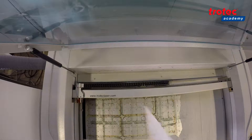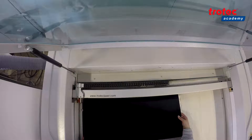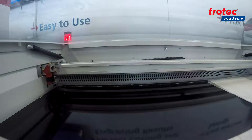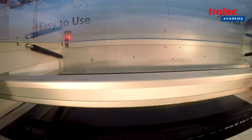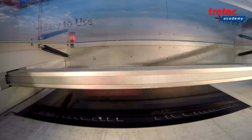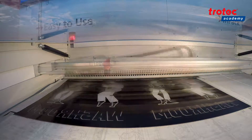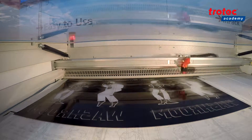To create this application we first flip our sign over and engrave the back with the first color. The artwork file has been mirrored horizontally to end up with the final effect that we would like. We then spray paint and let the spray paint dry. We put the sheet back into the laser to engrave the second color, which we then spray paint and allow that to dry. Finally we put the sheet back into the laser and cut out our final shape.